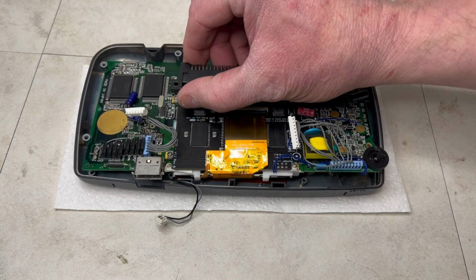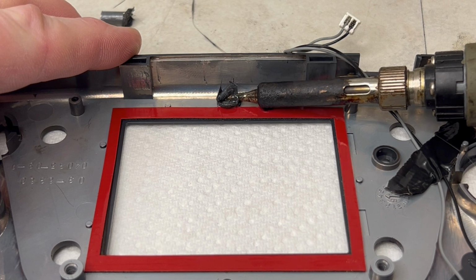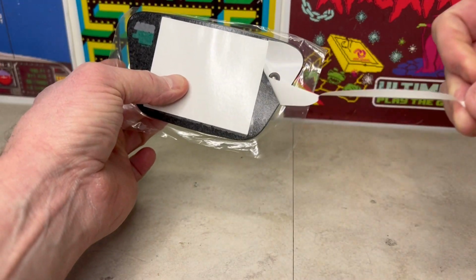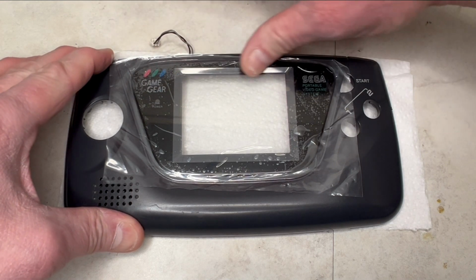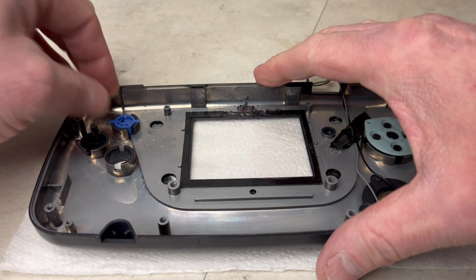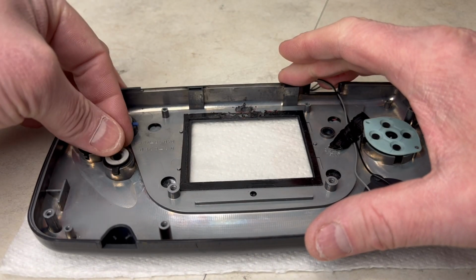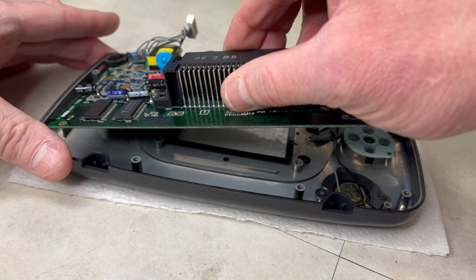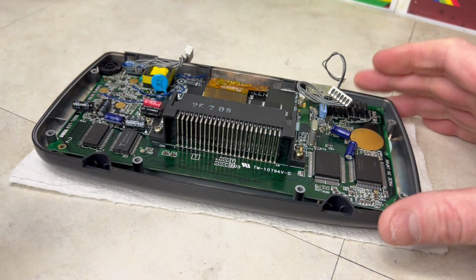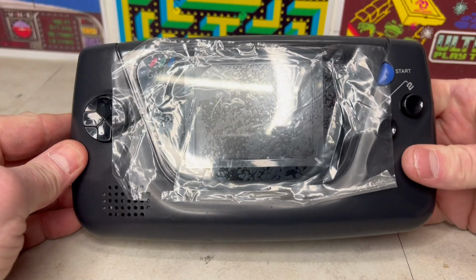Having attempted to install the motherboard within the case, unfortunately there was a standoff in the way. So removing it using the soldering iron seemed to do the trick. Then removing the back adhesive pads and pressing it down onto the case to ensure a snug and tight fit. Not forgetting to locate the buttons, which interestingly are keyed, followed by installing the main board and securing it down, and finally locating the extension port cover before the big LCD reveal.